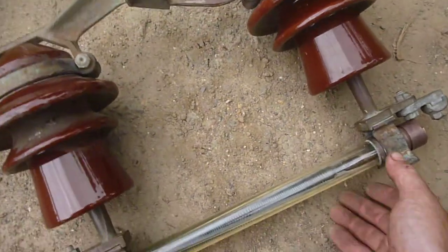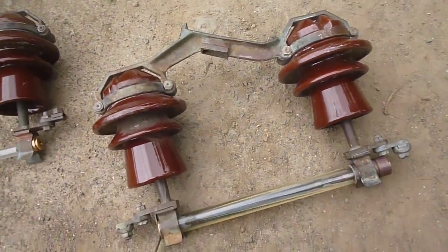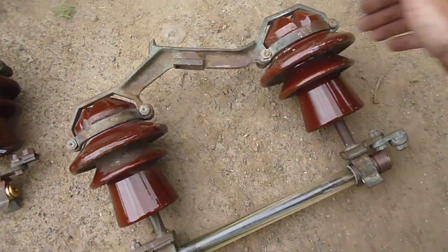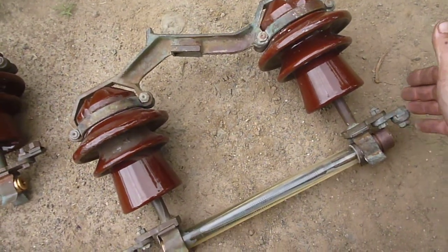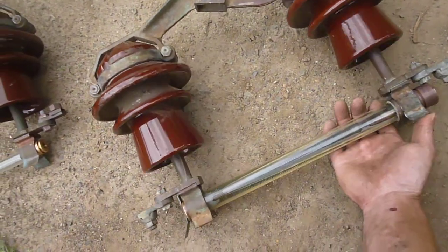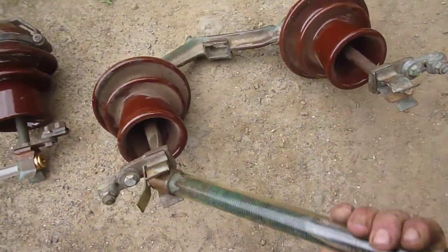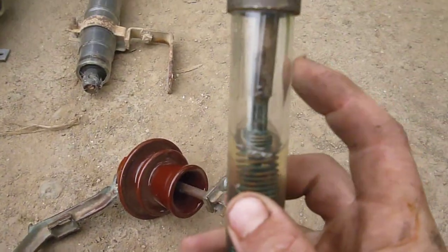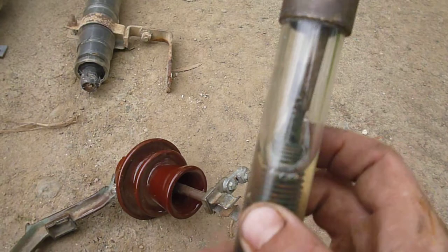From the same sort of era we've got two pole fuses. This is the way they were mounted on the cross arm — the cross arm was bolted up here, the power was connected over here, ran through the fuse, and came out into the transformer.